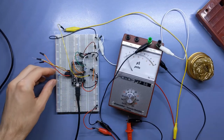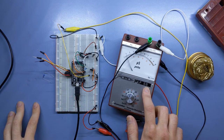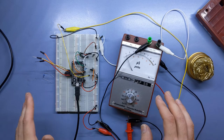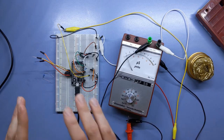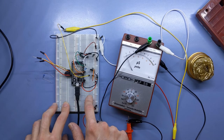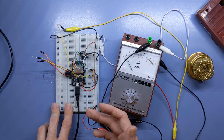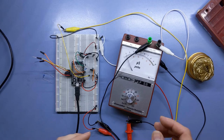After adding the transistor, I was curious how it would behave since the device outputs AC, alternating current, on the probe. This is because water electrolysis, as would happen with direct current, DC, is not really beneficial when measuring conductance. Here, AC has some consequences. For one, this setup really shouldn't work, should it? After all, we are switching AC with a transistor, which isn't really what they do, at least not on their own. But somehow it does work.